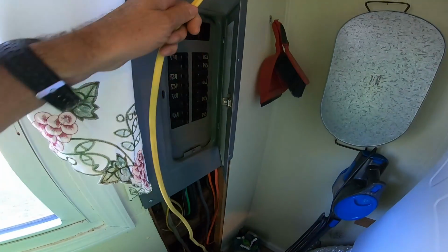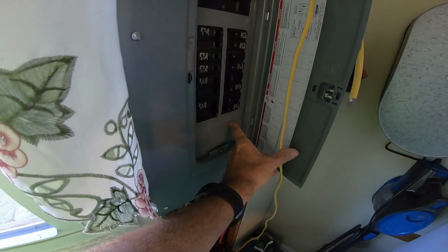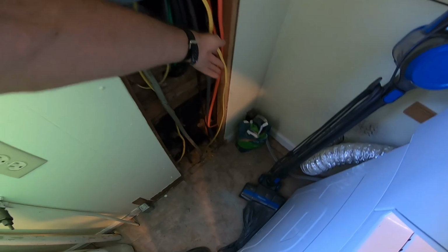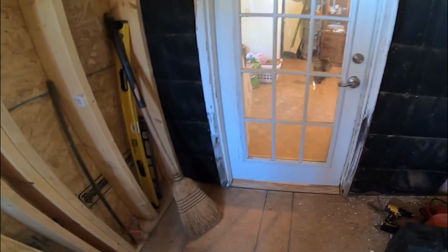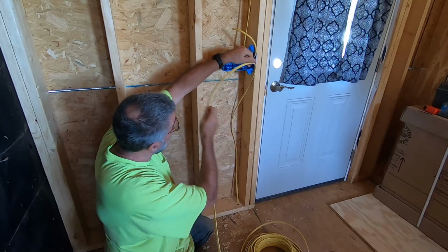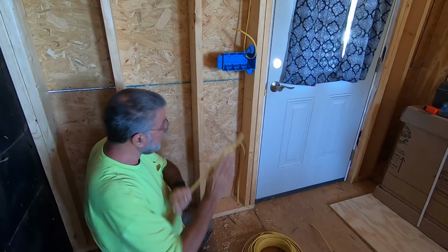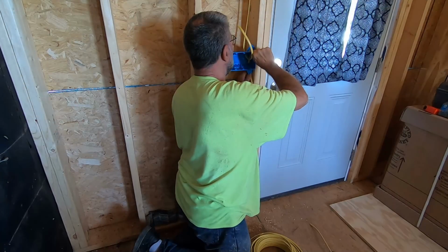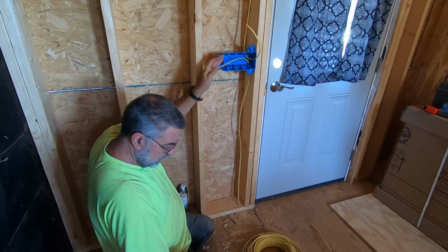And here's the wire that I just pushed up through down there at the bottom. And this is now long enough to be able to wire it in to a circuit breaker that I'll put right here. So I got that part of it done. I need to staple this yet to the wall. So now I got this wire run over to the panel where the power comes from. Oh no, shoot. Cut this a little long, I wasted some of that.